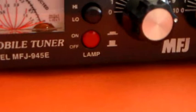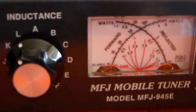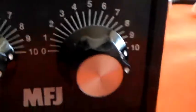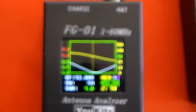As you'd expect, we've got very little inductance in there. It's a 945E. We've got very little inductance on there — it's on L, which is the minimum inductance. And it's on 9.5 on the transmitter and on the antenna variable capacitors. So that's very minimal capacitance as well. So you've got minimum inductance and minimum capacitance there, but it is giving a reasonable match on 6m.